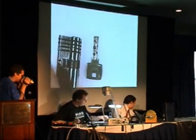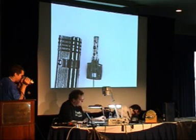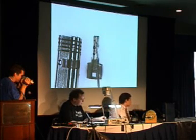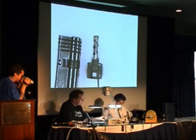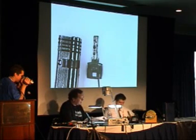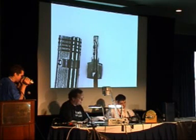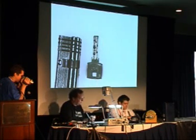I have here a cutaway DOM lock — D-O-M. It has five dimples, which means just holes. And here's a little ball. The little ball is an extra protection. When you insert the key into the lock, the little ball will be pushed up, so it reaches a higher point than the blank normally can get. That's also a copy protection because in this way nobody can make a blank for this key.